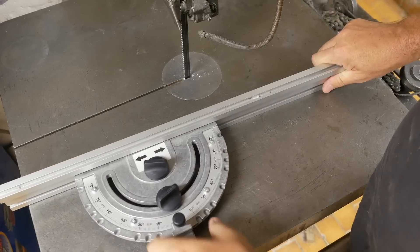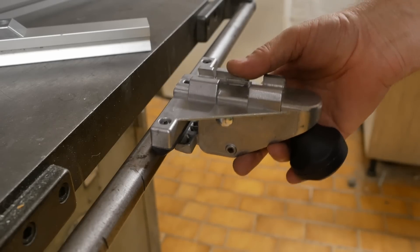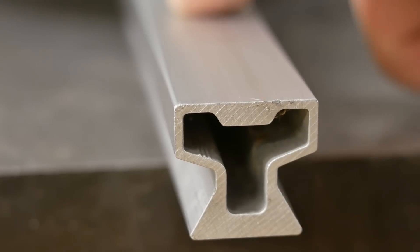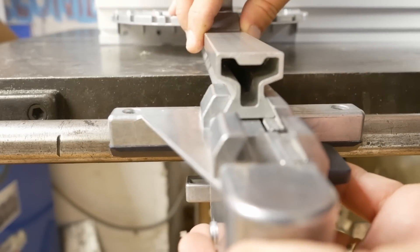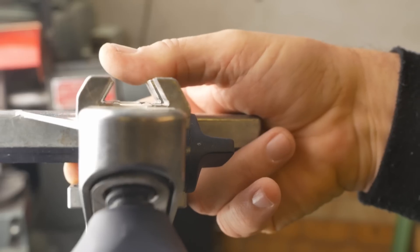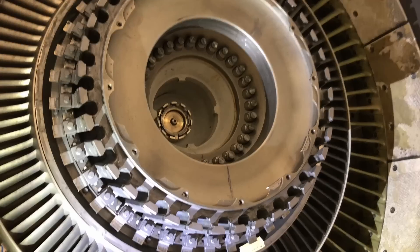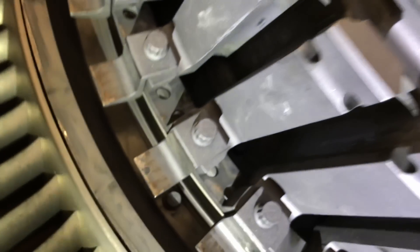It's easily adjusted. This guide foot isn't going to work, at least not without some modification. The horizontal adjustment is done with this pretty meaty extrusion that just slots into this clamping foot normally. By the way, speaking of dovetails — have you ever wondered how jet airline fan blades are mounted? They're also done with dovetails. Generally fan discs are titanium forgings. I'm pretty sure they wire EDM the dovetail slots in, but they may also be some form of shaping.